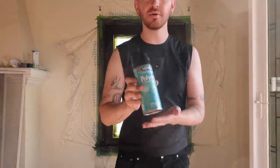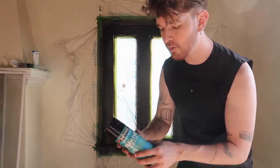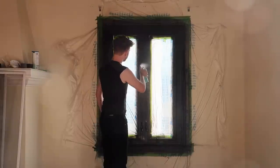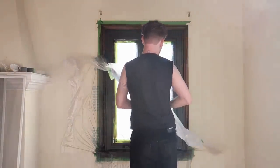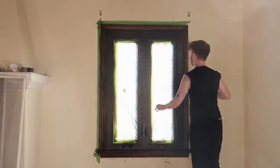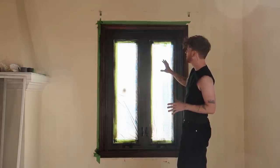Our last and final step on these windows is going to be applying a polyacrylic clear coat — this is a clear matte finish. I'm going to do one good coat over the entire window and then do a second coat just on the handles, because those are going to be the only area that's really touched on the window. The brown is perfect, I love it — it looks amazing. I absolutely love the dark brown. It's like almost black but it just has a warmth to it and kind of blends into the wood of the window a tiny bit more. Of course I still have to paint this wall as well — I'm just working on the windows first.